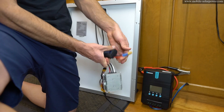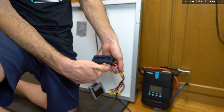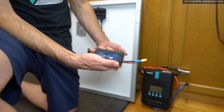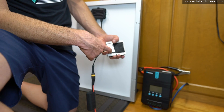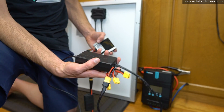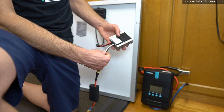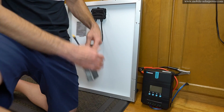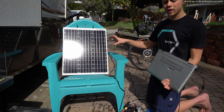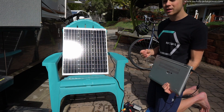You could also put this watt meter on the other side — connect your appliances to the watt meter and see how much power they're using. What's really smart is that the watt meter tells you what voltage is coming out, and that's the most important thing to get right. You need to make sure the voltage coming out works for your appliances. Because this is a 12 volt system, most 12 volt appliances can handle up to 14.5 volts, so if your converter outputs under that — or even 14.7 — it will be fine. Check out my website to learn more; this is probably the cheapest way to get into solar power.